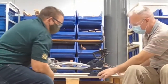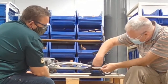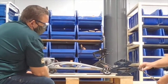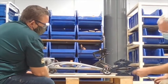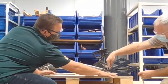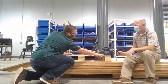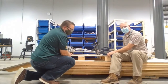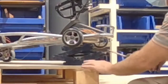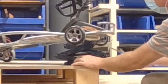This is a screw jack. Just like your threaded fastener, this jack has a screw in the middle. As I turn this handle, I turn the screw. As I turn the screw, it's threaded into this part, which draws these two parts together, effectively raising this up. You want to see how it works? So all I have to do is turn this handle, and as I turn the handle, you can see how the jack moves upward.